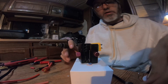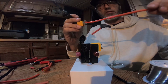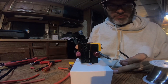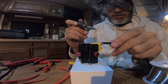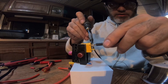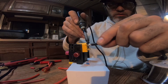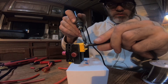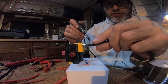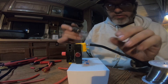Got those good and tinned. Now here we have positive coming out, so here we want negative coming out. We'll start right up on top with the negative — with that first wire I tinned — get that heat in there so it's on the wire and on the XT60 post. There we go, now it's all seated in there good. Let it get nice and settled, then we'll come back and put the extra solder — this is a step you probably wouldn't need with a regular plug.